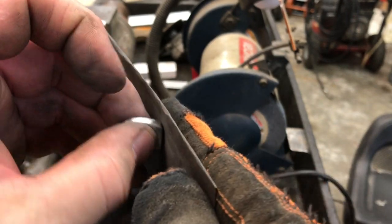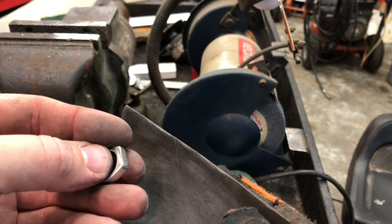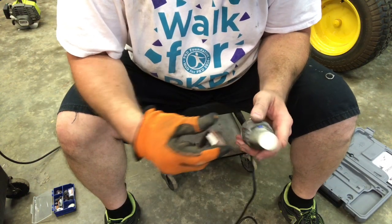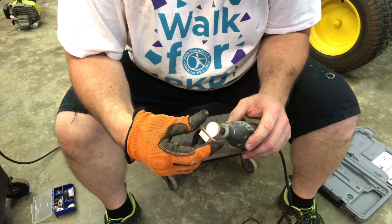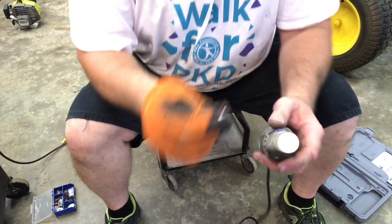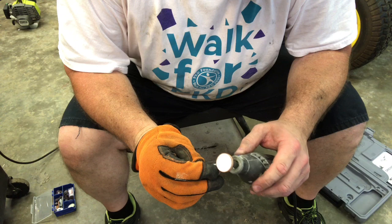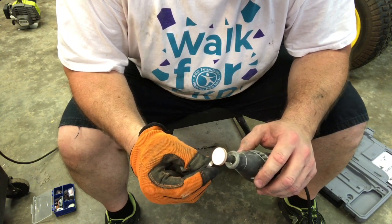You can see it's starting to look pretty good. There's just a couple small little imperfections, and you can keep just sanding on them and working them totally out before you start the buffing process. With our little Dremel tool here, we're going to take a little bit of this rouge on a pad, load it up real good, and we're going to go ahead and high-luster polish this up. We're going to start off with just a slow speed and crank it on up as need be — this is a variable speed polisher.